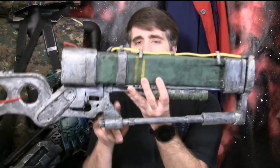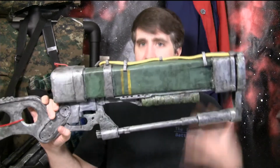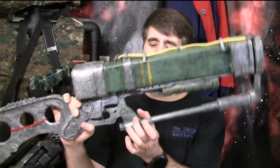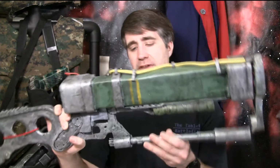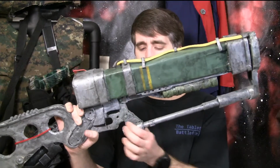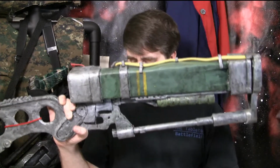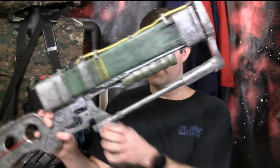So what I'm going to have to do is modify this attachment point down here, because this is where the real flexibility in this part is. I'm analyzing my design here, and you can see that that is where the weak point is in terms of allowing the structural piece to move around, because this area right here is just foam. It works, it's lightweight, but as you can see there, it doesn't really hold things together very well. So what I'm going to do is replace these parts here with some wood pieces that will then, in one way or another, I'm not entirely sure how I want to do it yet, put a bolt through the aluminum piece and secure it that way. So if I want to get access to the electronics, I'm going to have to remove two bolts, two up front here and then one back here, and this whole support front piece will come off as one.